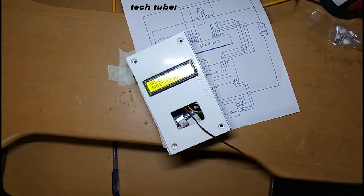Now for the programming part — you cannot make this clock without it. You need to follow the programming very attentively because it's very important, especially for the LCD display, text positioning, and the clock module. You need to set the initial time on the clock module, re-upload it, gather the time information from the module, and print it on the display.